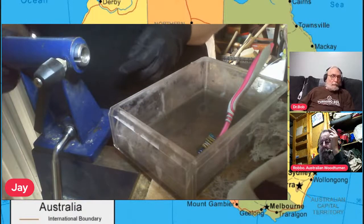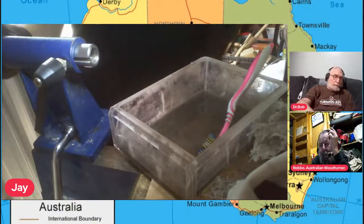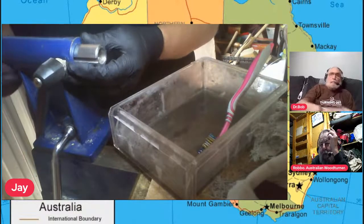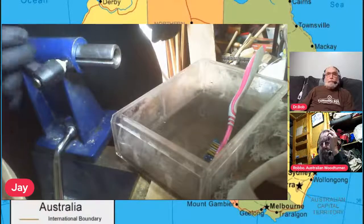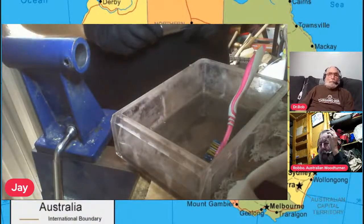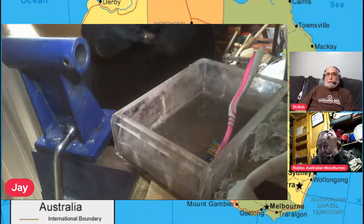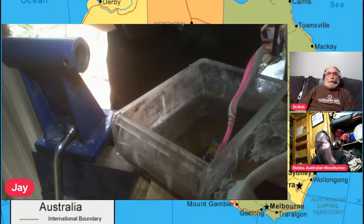All right. Now, wind it out with the jigger, all right? Yeah. Well, you can push it out, actually. Righty, I just slide it out now with your hands. Take the spindle lock out. Yep. Okay. Right, now, take your threaded piece out of the quill. Now, get a cap full of oil. And take the rubber gloves off.